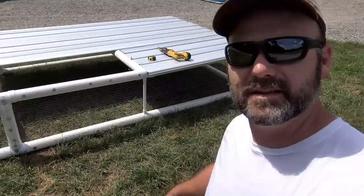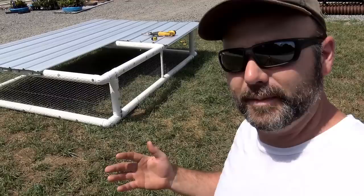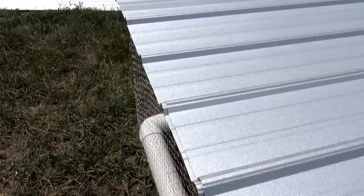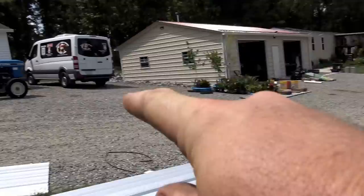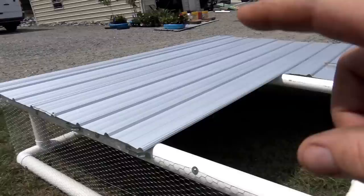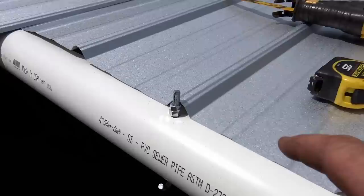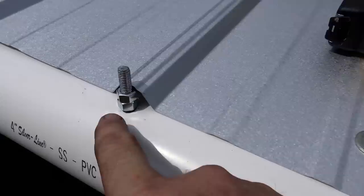I have two handles mounted over here — I'll get you a close-up of all this in just a few minutes. I want my tin to be evenly spaced and I also have to leave room for this bolt right here. We're going to have to cut the bolt off — that's the bolt we use for hanging the feeder and the waterer. I've got my tin evenly spaced but I don't want it to hang over, so we've got to make sure everything is even. The overhang is the same on this corner as on this corner. This piece of tin will go in this section and serve as our door, so we'll need to put some hinges on it. We also have to put a washer in here so it never pulls through.